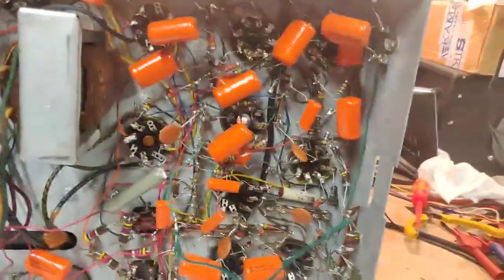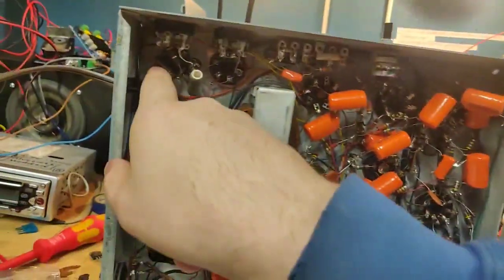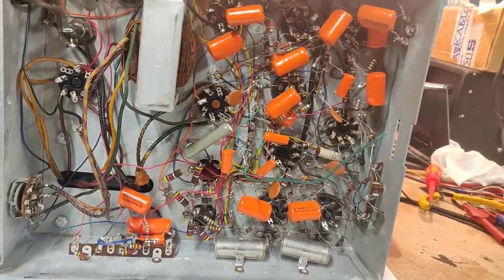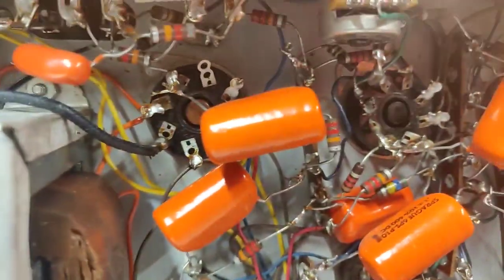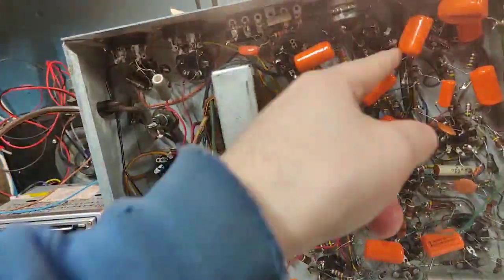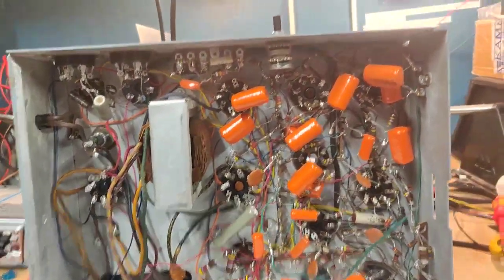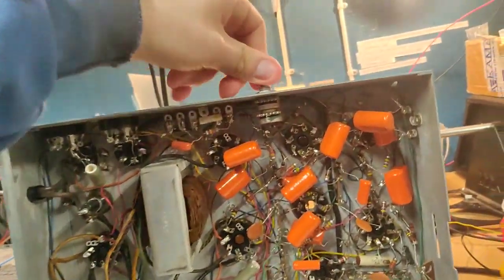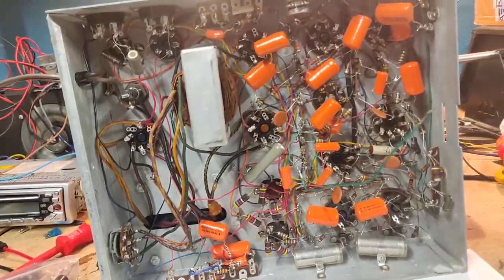I think I'm probably going to change a bunch of them. Also, it looks like this one here has already been changed at some point and it has been overheated, so we need to change a few resistors out. We're also going to get rid of this absolute mess that somebody has done with the recap job, because I'm going to remove the leads and make it all pretty. This control can stay, but I'm going to put it on the input as a volume control instead.